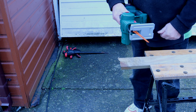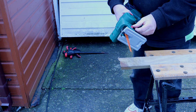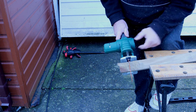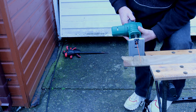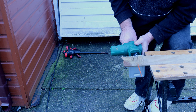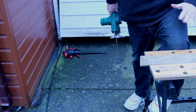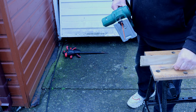Now with the sabre saw wood-cutting blade in, folded out into sabre mode, pendulum action off. Trying to saw through some triangular wood — it's a bit hard to grip, but once repositioned it goes through it easily. Obviously quite soft wood, but that's what you'd use this mode for.